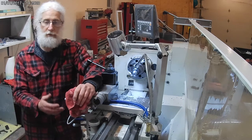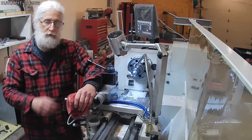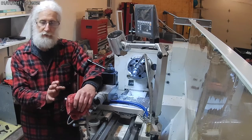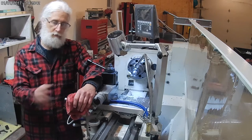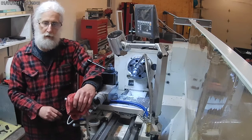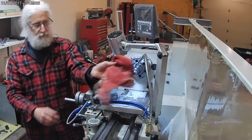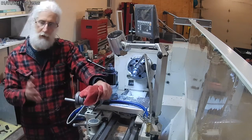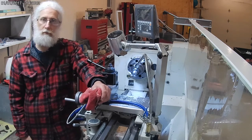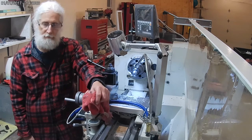The basic premise of it is that you don't have to crank the tailstock all the way back every time when you clear your chips in the drill. You just turn it back about a half turn, and then you pull the tailstock out, clear it, and then put it back in and turn that back to where you were and start drilling again. You use the lock, release and tighten the lock each time you do that. I'm not the greatest at explaining it. Best thing, just go over to his page and look it up and watch the video, along with many others that he has.